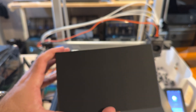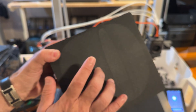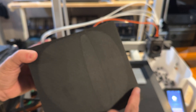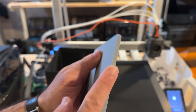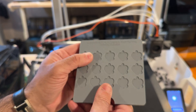We also produced an ink box — it doesn't require a massive bed, but I was happy with the overall quality and dimensional accuracy. There's some discoloration on the bottom that I think happened because I took it off the bed too soon before it cooled, causing the flexing effect. From a jig perspective, we do a lot of jigs in our business. It's important that there's no elephant foot on the sides — this came out pretty flat and dimensionally accurate and will go into the machine without a problem.